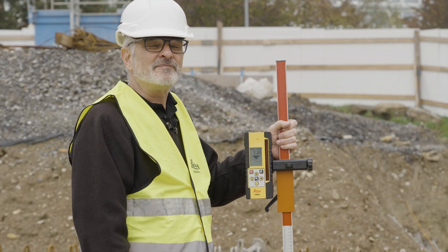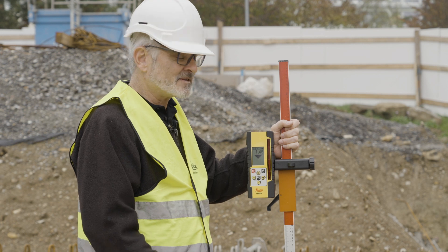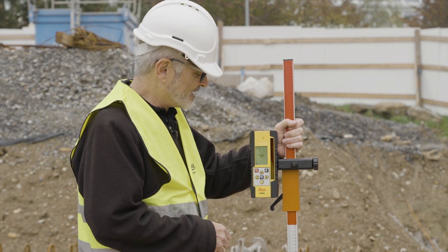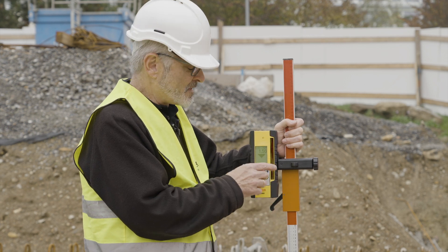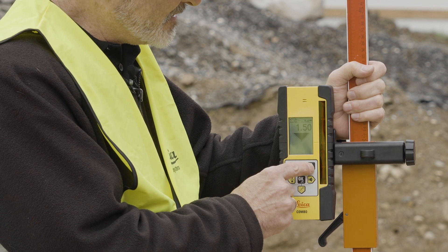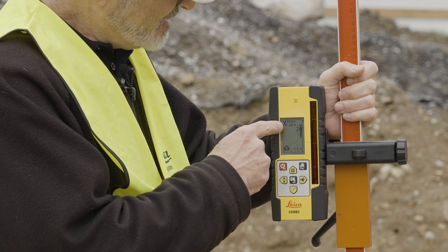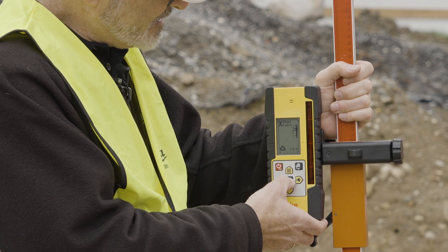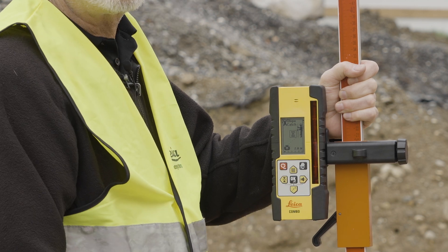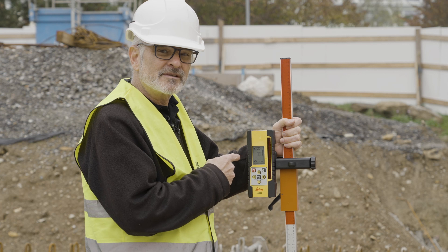The second part of Beam Catch is to move from your reference point up to the top of a slope. I'm simulating one here on the job site, but the process is the same on a regular job site. I've moved my staff without moving the receiver to a higher point. I'm going to use the Beam Catch feature — this button here — and select in this case the x-axis. I simply say OK to get it started and now I have to wait while the laser beam traces up and down looking for the center point.